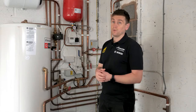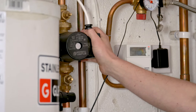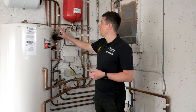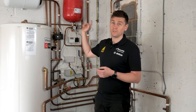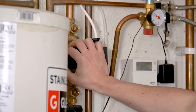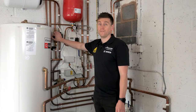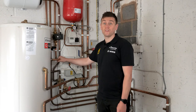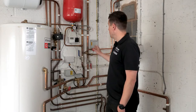We've also got a secondary hot water pump here, which minimises dead legs on the system. With the cylinder in the garage, this pump circulates hot water in a loop so that rather than waiting 20–30 seconds for hot water at the kitchen sink, you get a draw-off in just a few seconds. If you've got a large property, a secondary hot water pump with the extra pipework is really worthwhile. There's also Legionnaires' disease to consider in regard to hot water safety around the home.